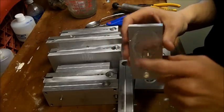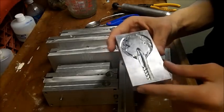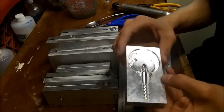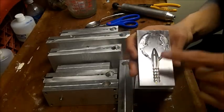You also have aluminum open pour molds — this is the Demery crawl mold. I can pour this very precisely because it has flat edges. Most of the time I don't have to trim this bait — I've gotten to the point where I can pour it without trimming. Maybe one out of every 15 or 20 baits I have to trim a little bit on the claws, but most of the time I don't.